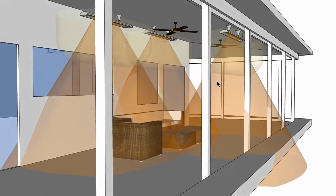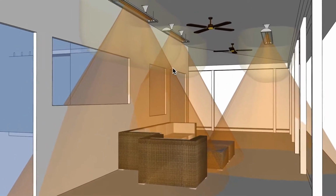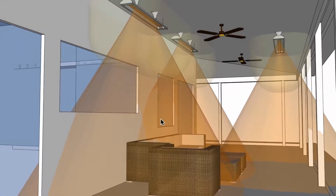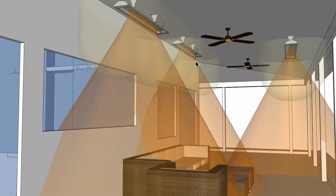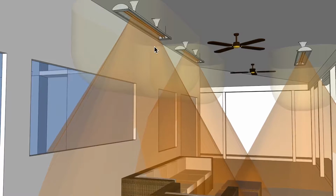If the 6,000 watts do not work and you decide not to purchase a control system, then I would go with a 4,000 watt unit, C model. So it'd be a single element 4,000 watt 240 volt as well.